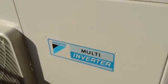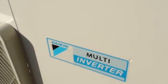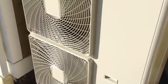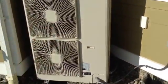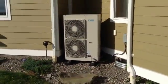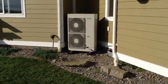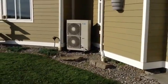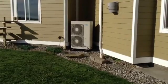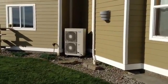This has two condenser fans. The unit will blow about 3,000 CFM. The reason why it's a double stack — Fujitsu kind of learned their lesson. They went with a single larger fan, but the fan was coming off of its hinges because the RPMs are just too much. So we have a double stack unit, which splits the fan speed so everything stays nice and dependable.